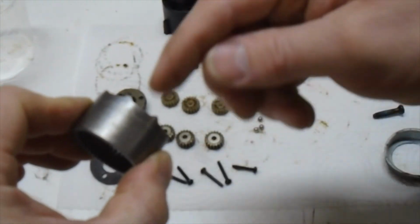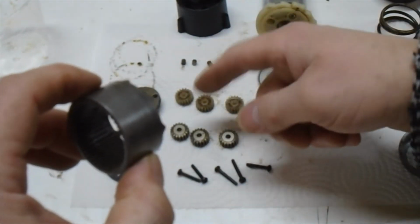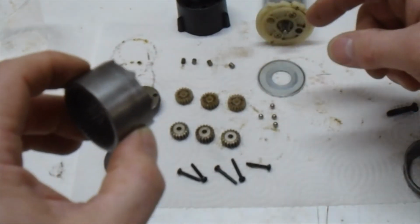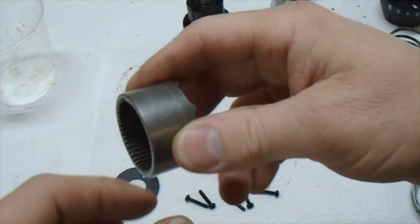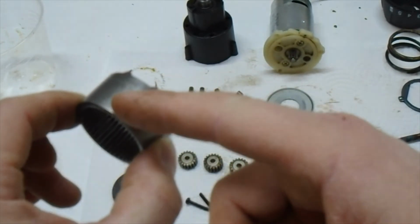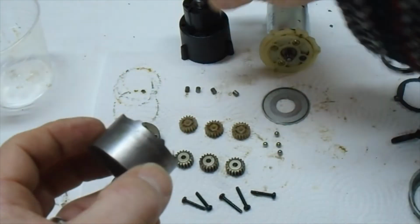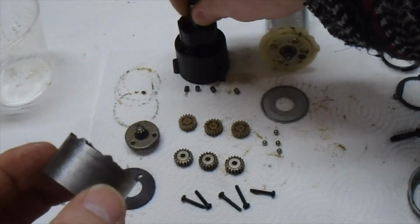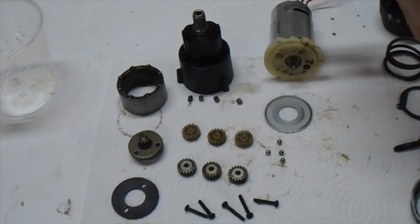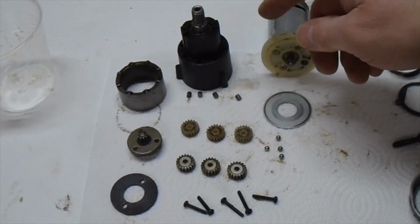So the front gears drive this thing, spinning this, and the second gear, and this is a sun gear, I think is what they call it. Planetary gear, I guess is what they call it. Sun planetary, I'm not sure. Running out of battery here, I just got shut down a little bit, sorry. But the sun planetary gear spins one, spinning the other, causing it to turn. The motor turns this, causing the main part of the drill to turn. That's where they get the torque from. The motor has low torque, or not a lot of torque. You up the torque by adding more gears in. So one set ups it, and another set ups it even more.